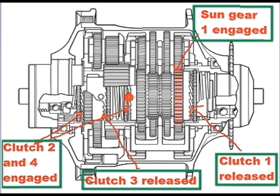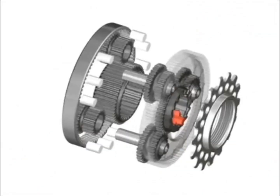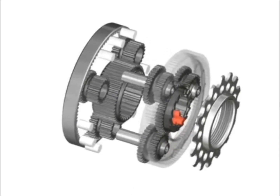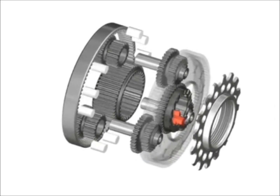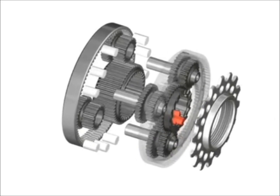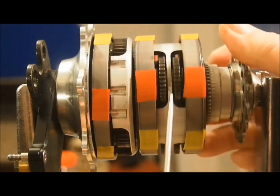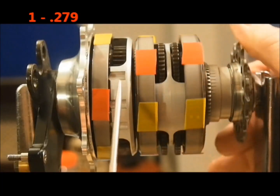No. 2 clutch is in the engaged position, coupling the planet carrier to No. 2 ring gear, so the ratio between them is 1 to 1. The low range sun gear is always engaged to No. 2 ring gear. The low range ring gear is coupled to the axle by a 4th clutch through the low range gears 1 through 7. Clutch 3 is in the release position in low range, allowing the sun gear to rotate independently of the low range ring gear. This means that in low range, the sun gear is the input, the planet carrier is the output, and the ring gear is the fixed reactionary component. The ratio between the input sun gear and the output planet carrier is 1 to 0.409. This reduction multiplied by the reduction in the primary stage combines for an overall ratio of 1 to 0.279.